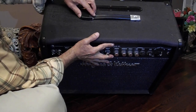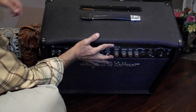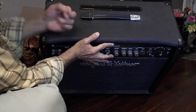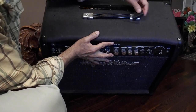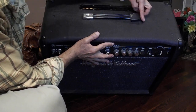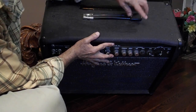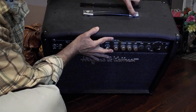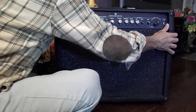Covers on the handle. Screw covers, they cover the screws on the handles. You pop that off with a screwdriver. Okay? Accidents do happen. You notice here, I broke that one because I tried popping it off from the front. You don't want to do that. You want to pop it off the sides because the clips are on the side there. So that's where you want to pop it off, on the sides. Then you're good to go.